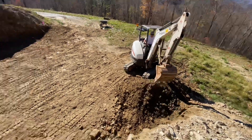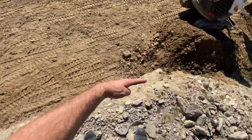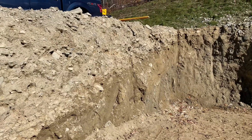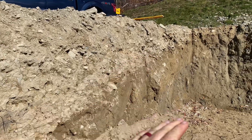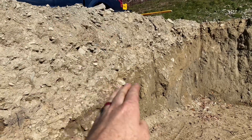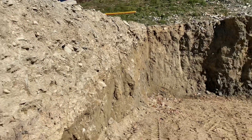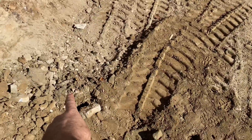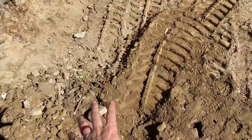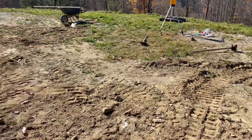We're having to do a little more digging here. We pulled the diagonals and laid out the foundation and this wall was going to run from like two feet out to bang right into this dirt bank, so that's not going to work. I want to show you guys the dirt in this cut. There's a line in it — the dirt from here down is original soil and from here up is fill dirt. You can't build a house on fill dirt unless you dig all the way through it and put the footings in the original soil, or compact the soil to some kind of engineering specs. We're good here because you can see the original soil line coming down right here. The footings are all on solid ground here, except for the deck piers. We may have to dig down out there because it may be fill dirt a few feet deep.